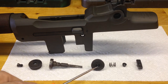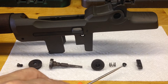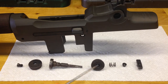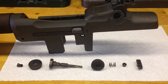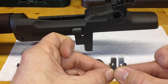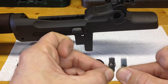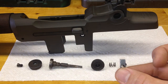The windage knob does not have anything on the inside of it — it's not pressed in like the older style. The spring is going to be with our bushing for the lockbar. This is the bushing; it has two nipples on it. Make sure this is clean, also inside the hole, and make sure your threads are clean on your lockbar. This lockbar is the later style — it has squared-off 90-degree ends. The earlier style had a rounded end. We're going to use the later style, which has coarser threads. This one came in two types: the earlier finer and the later coarser.